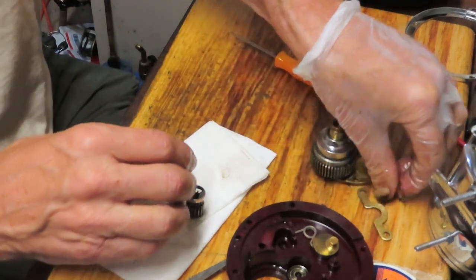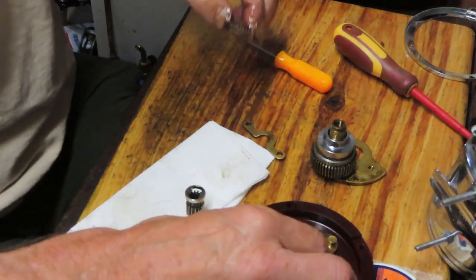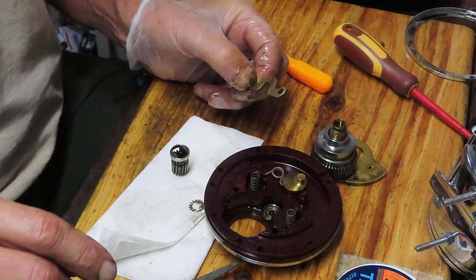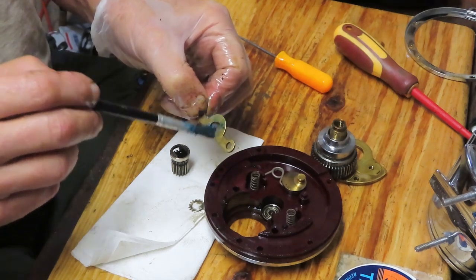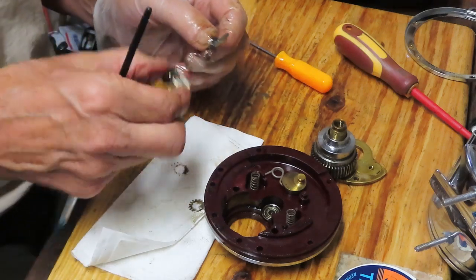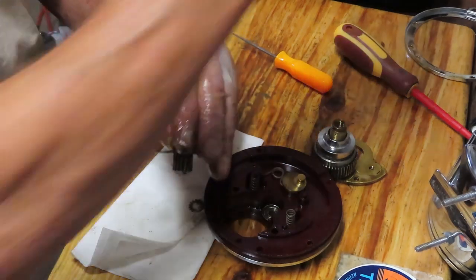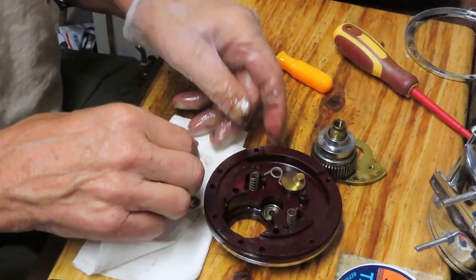and it's slowing performance. I'm going to take our yoke assembly. You have two springs that go into the side plate. Put the grease on the yoke. I use an artist's brush to spread the grease. I like that because the hairs generally stay on the brush and they don't fall off and fall into places that could impair performance. All right, the yoke is done.